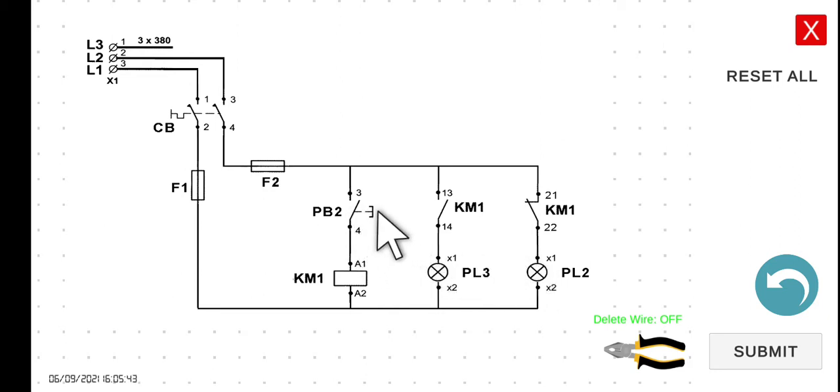However, if you press this one and hold, this coil here will be energized. If this one will be energized, this one will close. This one will be turned on. This one will be off — it will be in open state and then this one will be turned off.